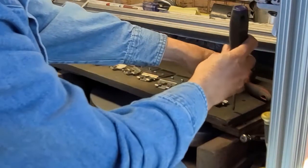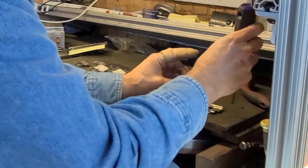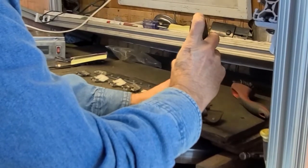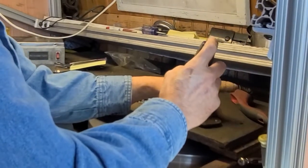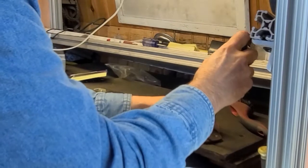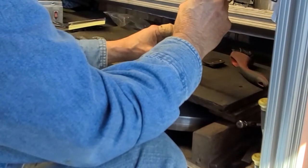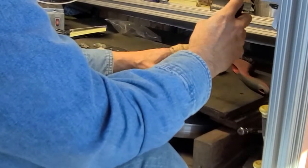Let's see if I can find that. Yeah, this is this one. Now you probably noticed that I did not crush the springs. Yes, I did notice that. 95% of the time, you don't have to do that. If the 5%, can you tighten it without taking it apart? No. Okay. But I will just change out the spring and the socket as a set. Oh, you just put a new set in there. Almost virtually always that takes care of any problem that I might be having with the blade not cutting, because the socket may be tilted from the way they take it on and off of the clipper machine.